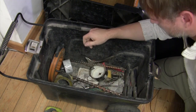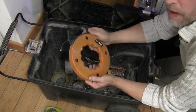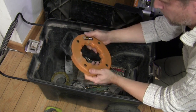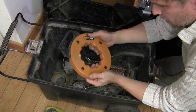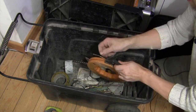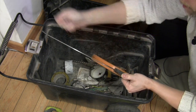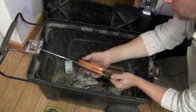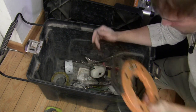Conduit cutters, fish tape — one of various means of getting cables where they need to be. From the rods to the f***ing useful wire to the fish tape, one way or another hopefully I can get my cable where it needs to be. It sort of pays out and you can shove it in places that perhaps rods can't get into, and then you can retract it back by turning the side there.